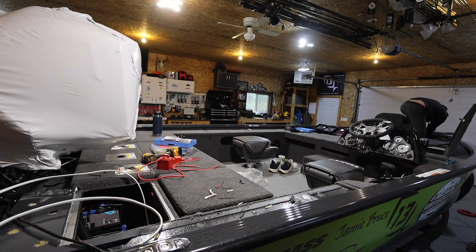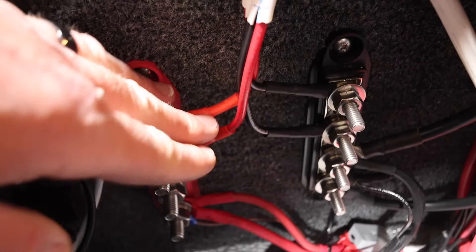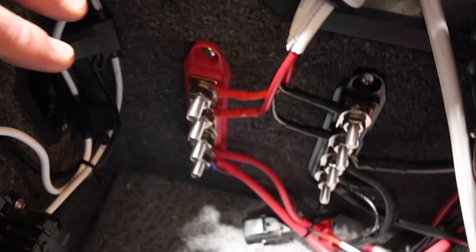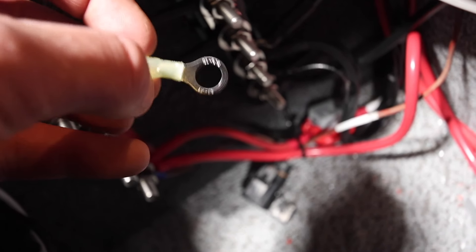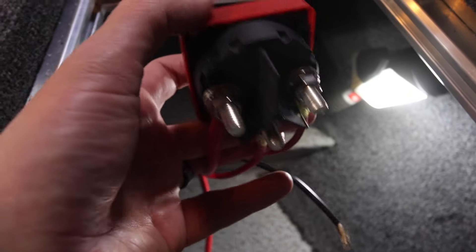This is where long arms help. Getting the back dialed up a bit here. Got a lead here for the bow, one here for the console. I'm going to run bus bars on the ends of each of those and keep the fuses up at the unit — I don't want a jumbled mess back here. I do have one more jack plate to add to this bus bar, and then that's pretty much going to be it for the back. Just try to keep everything tight, square it away, use your mounts, use your zip ties, and I've got each of these labeled. One thing to note on these ring terminals: there's a flat side where it's raised up on one side — you want that to the back. Otherwise it'll mash that terminal down, and that's not a good scene. It's obvious, but something to keep in mind.